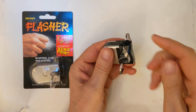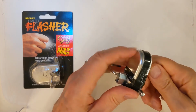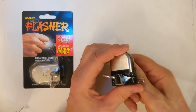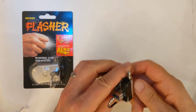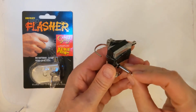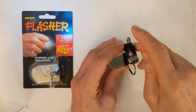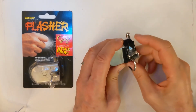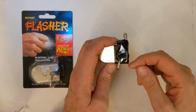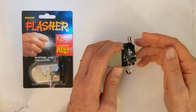I thought the problem with the key spinning and the main wind-up coil unwinding prematurely was the metal tab at the end of the plunger, but it turned out not to be the case. The problem was the bigger spring, this plunger spring, had lost enough of its tension that it wasn't pulling the metal tab up against the abrasion wheel to prevent it from spinning.